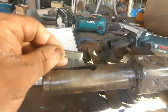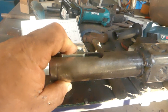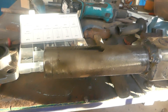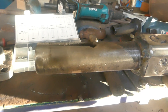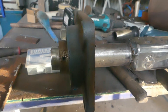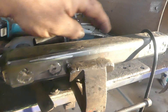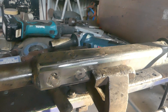Here I've got a piece of key steel and you can see it fits in there nice and tight, but it's not long enough. I've actually got some in a long length and I'll make up a proper key for it — I think I'll use a long piece the full length of the keyway. You can see that the bearing still goes on and the end hasn't been expanded or anything, so that'll all be okay. The next step now is to weld some double lots of flat bar, four of them along each side staggered, and that will create a place to put the hammers.